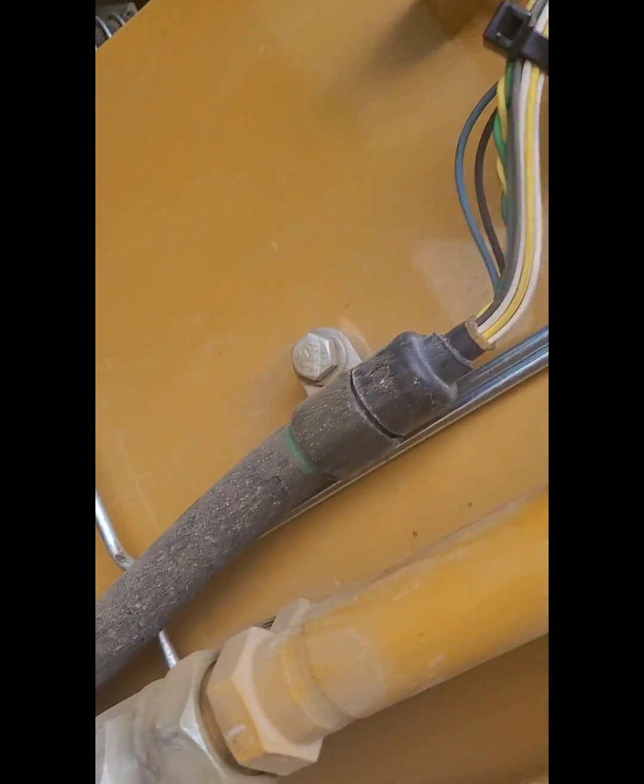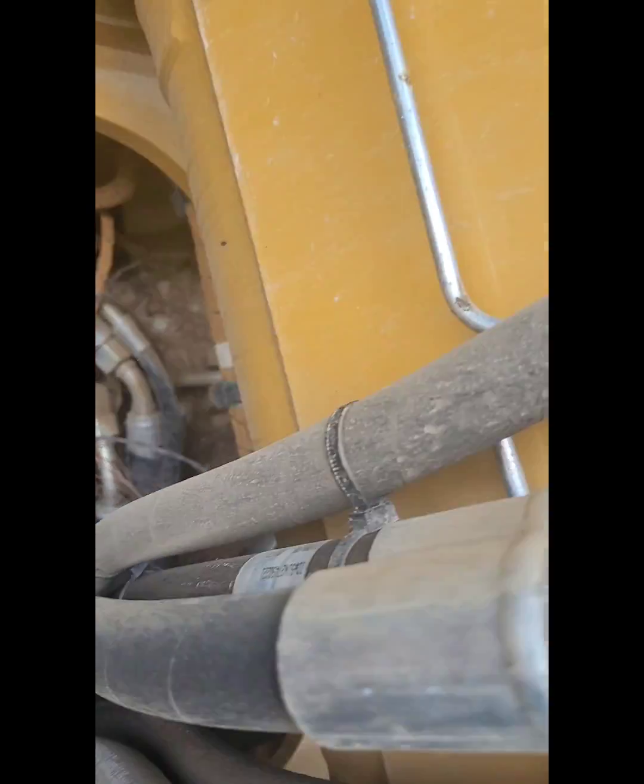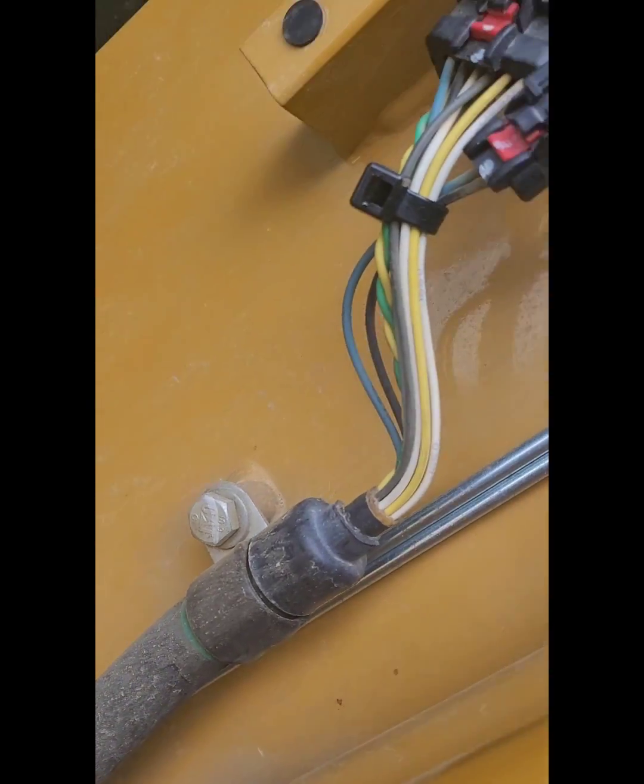In all honesty, if you're really looking for a repair, about 95% of the IMU issues you'll have on next-gen excavators will be in the boom foot harness — regardless of whether there's an open service letter or not. The larger machines always seem to break at the same point, right where the boom meets the house.